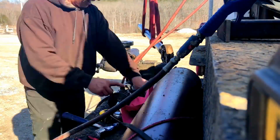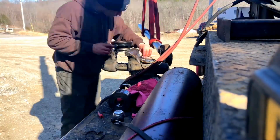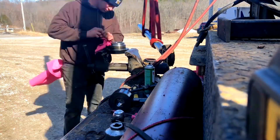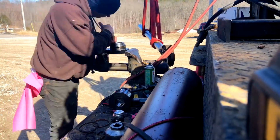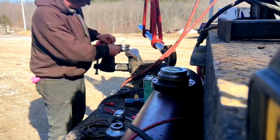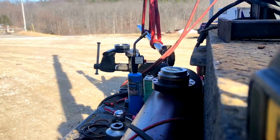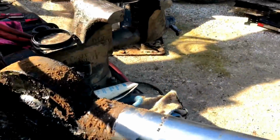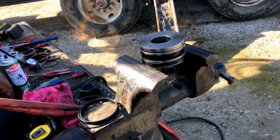All right, here I am. I got that hanging out there, and I'm starting on the gland. I go in one side, and I beat the dust ring in and do all these knickknacks and do the other and flip it over and do this, that, and the other. And got it done, and I actually got it lubed up with the assembly grease. Started on the piston and getting it down to the wear ring on the piston.